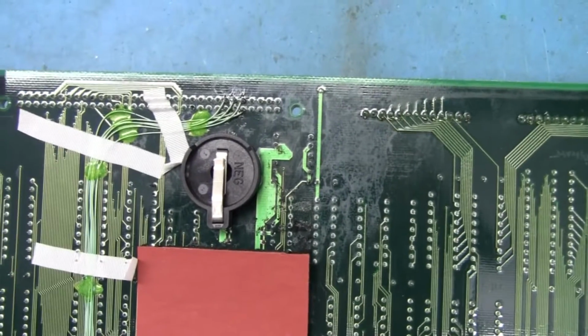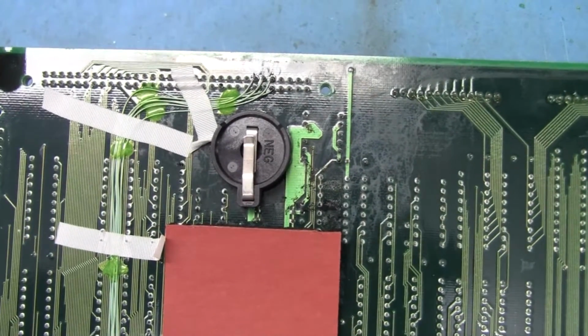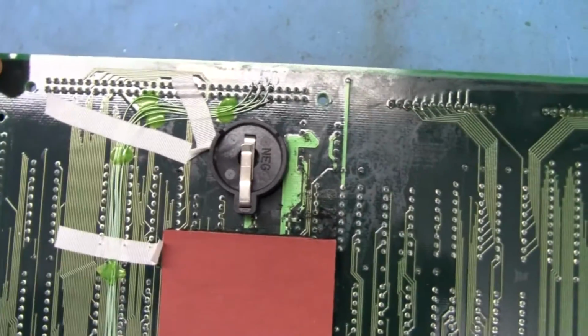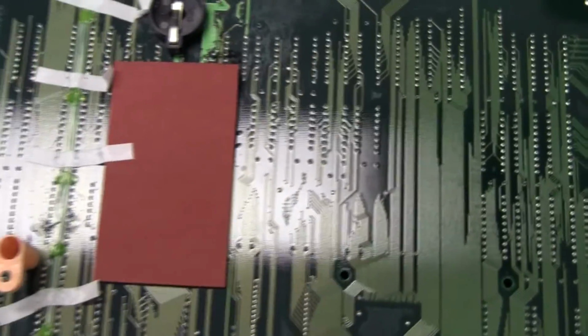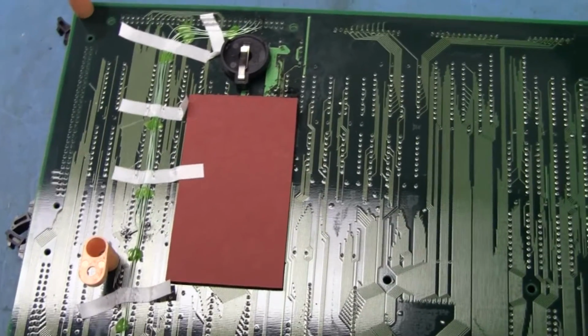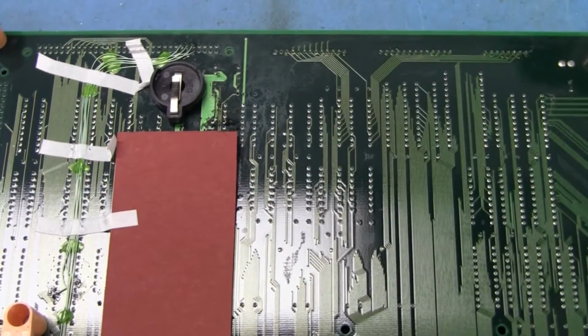I prefer to solder them on the back side of the board, just simply so that when you go in and replace the batteries in these, you can replace the battery without having to take the board stack apart. You know, these 4-slot boards, you've got a top board, and then you've got all the screws that go in through these connectors here that hold it together, and you've got the screws that go into these feet here for the slots that hold those together, and then you've got the metal cover that goes over them. That's a real pain in the neck to go in and remove when it comes time to change your battery out. So if you solder the battery holder on the bottom, works great.